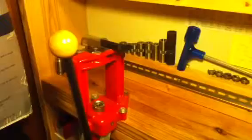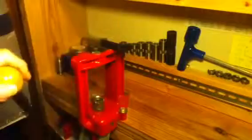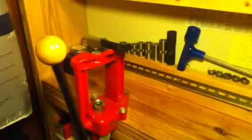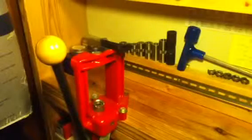But I thought about making a device that clamped with a couple of cap screws that would pull it together, a two-piece clamping device that would sit on top of the press, and then I could pull the bullet out that way. And then I realized a collet would be a good way to do it. I was thinking about a 5C collet like you'd use in a lathe. And then I realized I've actually got some collets. I've got some ER20 collets I use in my milling machine.